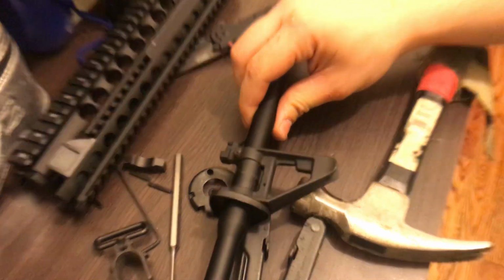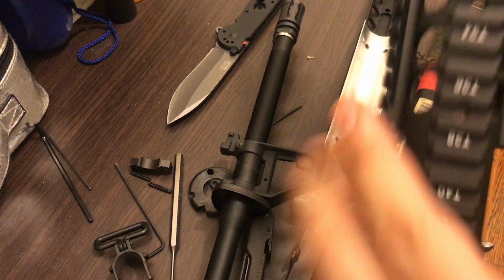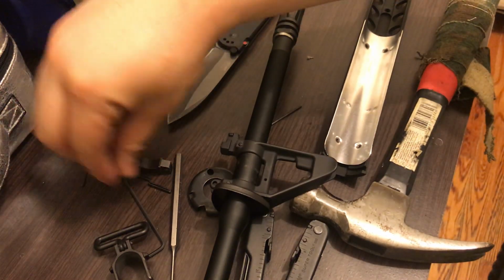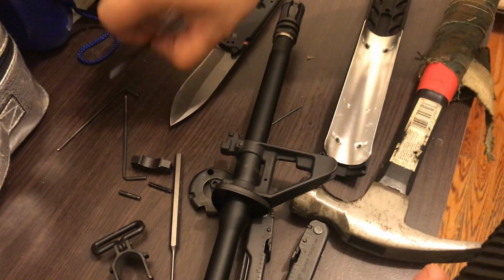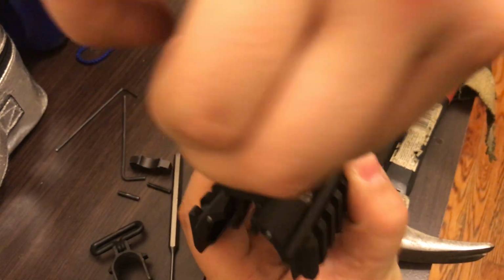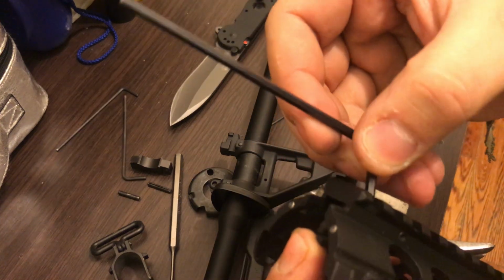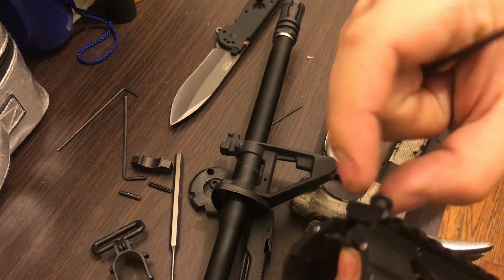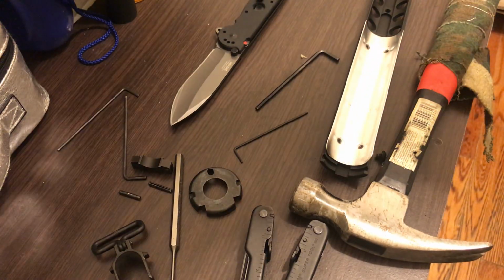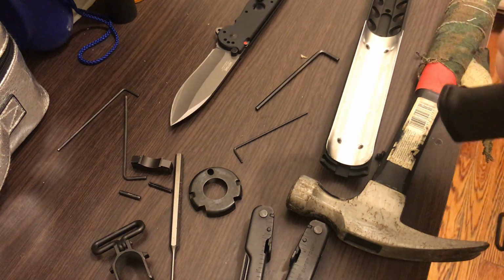Now, next thing you gotta do before you can put the plates on, this is the bottom one. The top one is gonna have at the back this Allen key. If I can find the right size. I personally undo it all the way, just makes things a little easier. Now this Allen screw is important, because it actuates these little prongs which grip inside of the top of the barrel nut. Now it grips inside the groove, so it allows it to be more secure and tight.